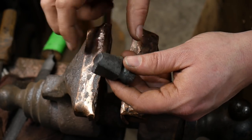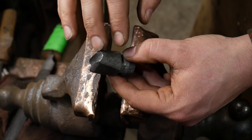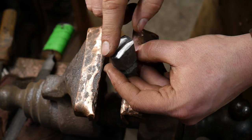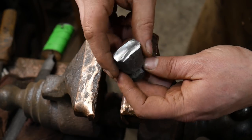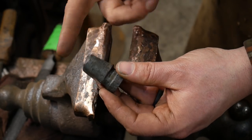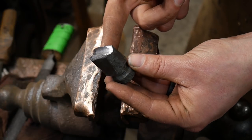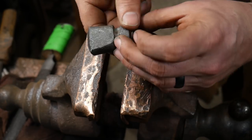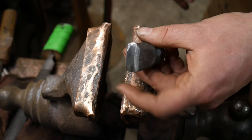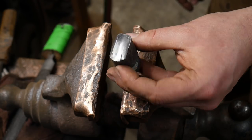You'll get a more tough type steel versus a glass-hard steel. If you do it in oil, only take it to a pale straw color; otherwise these edges will deform. Since this is a water-hardening steel, it won't achieve its maximum hardness in oil. So anyways, I'm going to take this and actually use it on a hot piece of metal. I'll go get a piece hot in the fire and we'll just use it as-is so you guys can see the result.